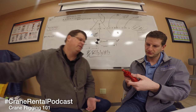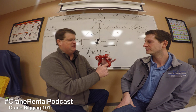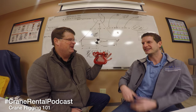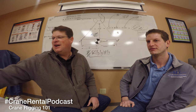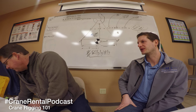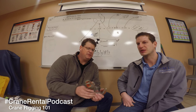The funny thing about sling savers is when you say 'give me a two inch,' it means two inches in the sling opening. But on a regular shackle, two inch would be the body bow size - so they measure a little differently. I like sling savers - they're easy to use, great for ACs, anything with sharp objects you're going to need some sort of softening and proper shackles.